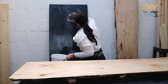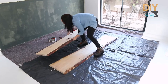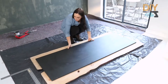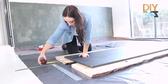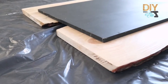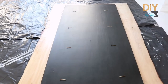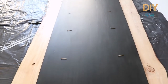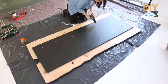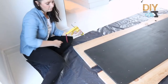This is going to help protect the surfaces as I transport it to its final room. Now I'm transporting the slabs and laying them on the underside facing down, so I'm working with the underside of the table facing me. Placing the pine panel so there's equal distance from the edges, and I'm going to attach it by driving in pilot holes and then attaching wood screws. Once attached, I use silicone around the edge to help the epoxy not leak through.